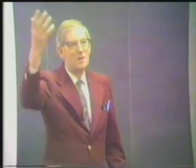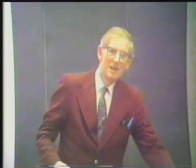And as soon as we put these blades on the older aircraft, when we had these old blades, we used to be able to struggle up to about 5,000 feet. We put these on, and the fellow was right up at 11,000, so it made an enormous difference, and for no increase in weight. And of course, the rotor speed was about the same because the chord was smaller. So we got an enormous improvement.